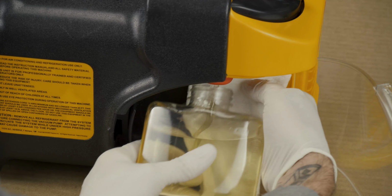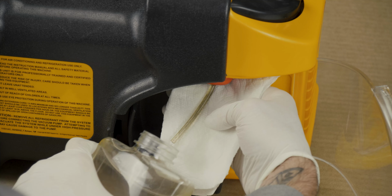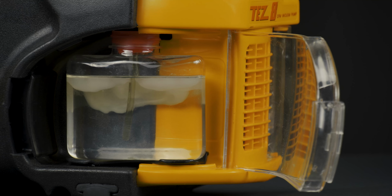Next, ensure that the pump is cycling clean vacuum pump oil. If the pump is still showing signs of contaminated oil, it's recommended to perform a flush procedure. The full TEZ8 flush procedure video will be linked in the description.